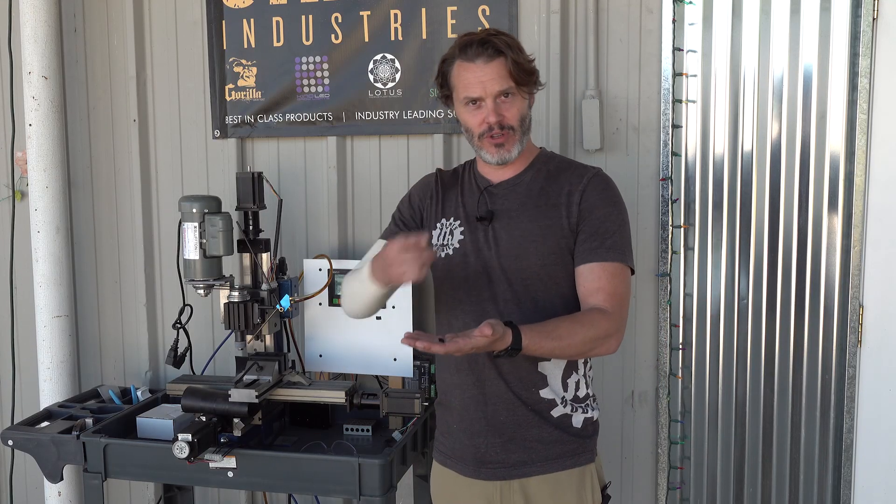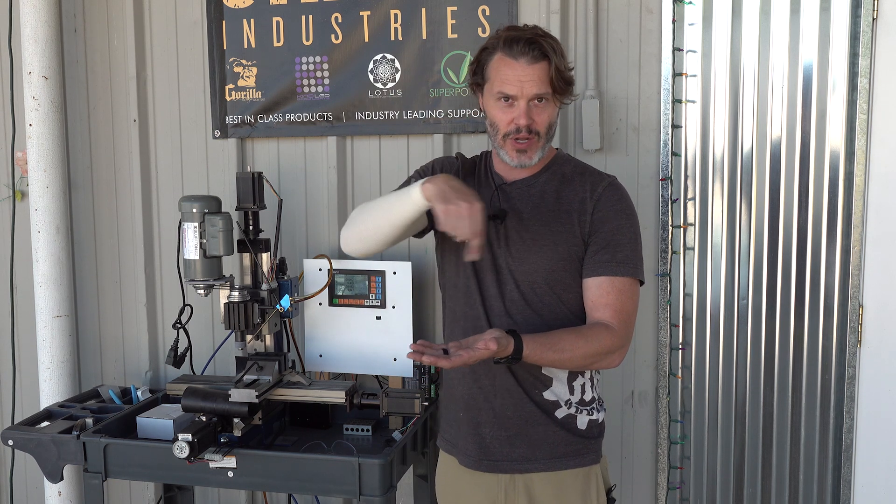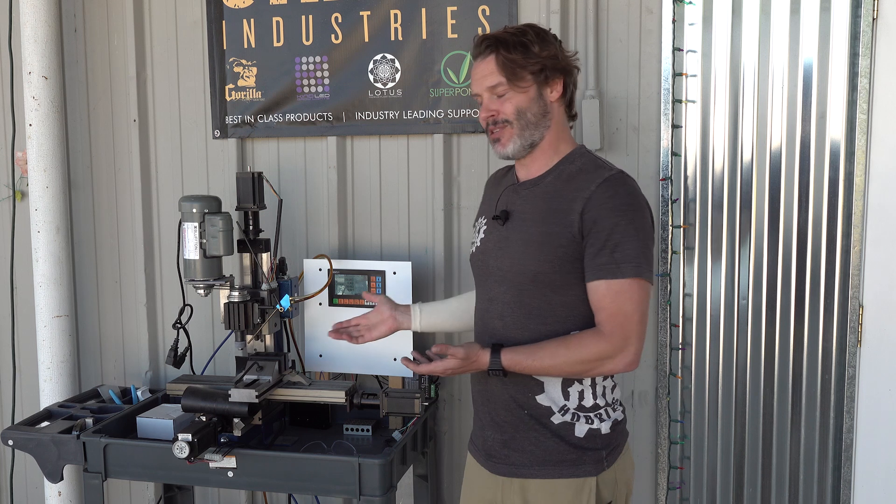I could also use my CAM output with SolidWorks for 2.5D machining, which means we're not doing three-dimensional fun objects — we just go down and machine, then go down and machine again. I could totally have it kick out code for us on this machine, but it's really simple stuff.